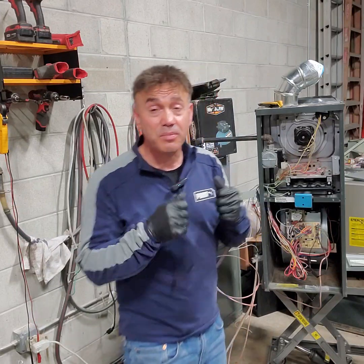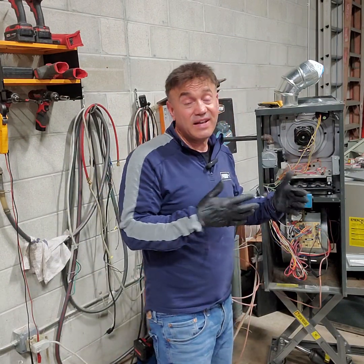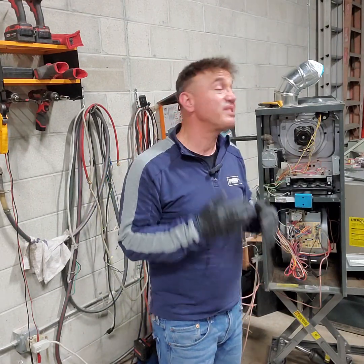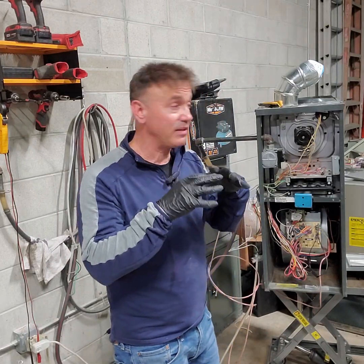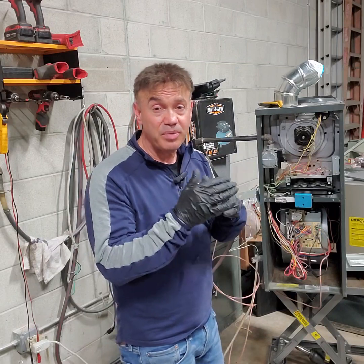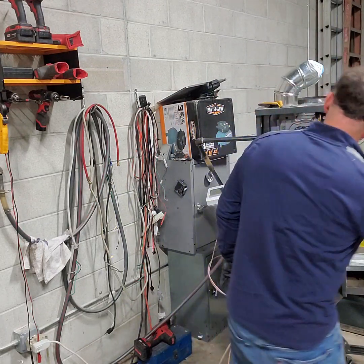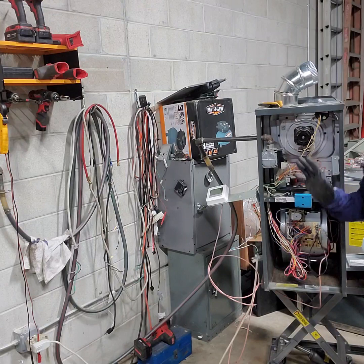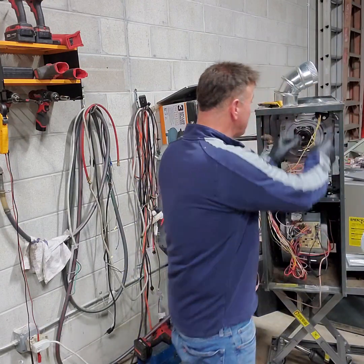The only time we jump that thing is just for diagnosis, because a lot of times we jump it as a process of elimination to see where the problem is, and we usually remove it. But I'm just telling you, only if the pressure switch is bad, I will show you how to jump it. You're gonna have to just replace that normal sequence of operation with manual sequence of operation. But anyway, you got the point. I'm gonna remove this now and see how the pressure switch will sense right away the normal pressure, and it's gonna go back on.